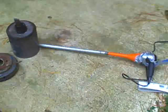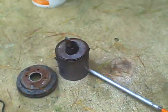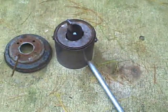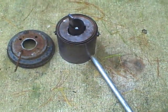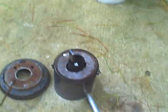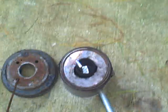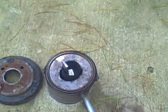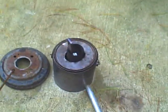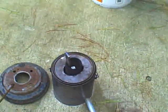This is a backyard $30 aluminum foundry. Basically it's a paint can with a hole in the top for the crucible to stick out. The crucible sits all the way down to the bottom, and inside there's just a bunch of charcoal. The crucible itself is made out of a six-inch length iron piping nipple — two inches in diameter and six inches long — with a two-inch diameter cap on the back end to hold in the aluminum.